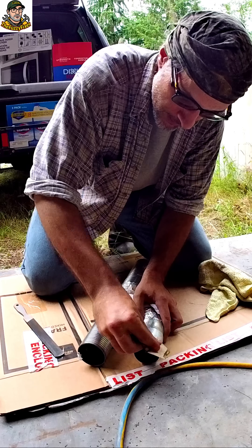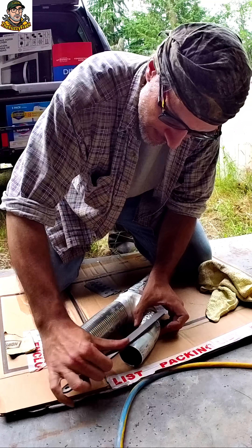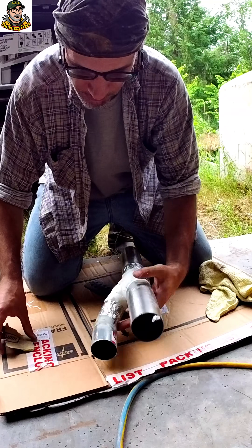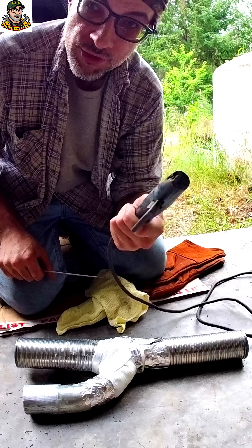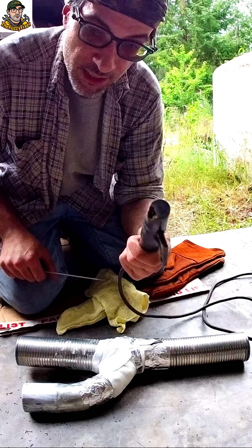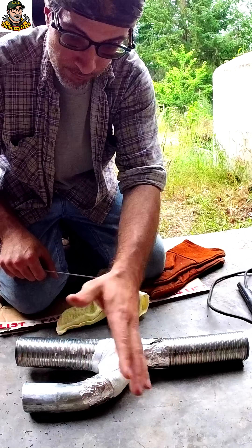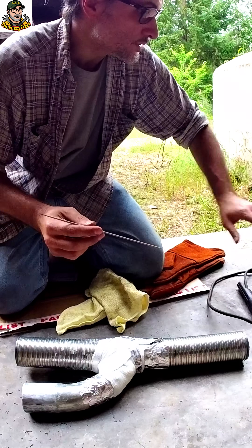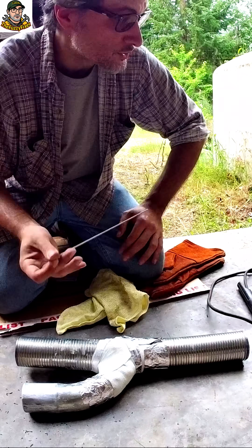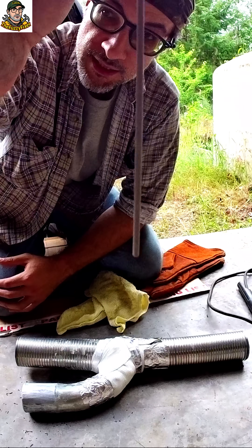Any glue, any oil, any sort of coating — I want to get that ground and sanded down as best you can so that way our electrode can actually arc and penetrate. The only welder I have working is an arc welder. This is going to be your cheapest option above MIG and definitely above TIG. Pretty user-friendly once you get the feel of it figured out, but these are meant for heavier steel, not so much very light sheet metal. So there's a high risk of burning through. We're going to be on 110, doing 45 amps and a 1/16th rod. Make sure your outlet can support that kind of amperage. This rod is meant for mild steel and sheet metal.